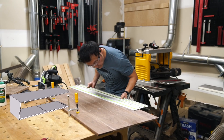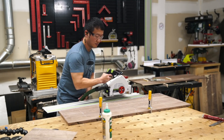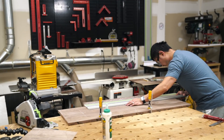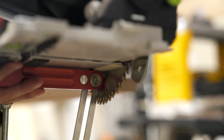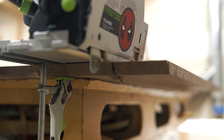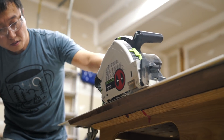I first cut the tapered edge on the right half of the top panel with my track saw blade set at 90 degrees. I'm mentioning the blade angle because the blade will need to be tipped at an angle that matches the taper on the left panel for the rest of the cuts, to ensure that the left, top, and bottom panels will match up. If I'd made the right panel the same way as the left, it'd be really difficult to get that corner to come together since the taper on the top panel would introduce a third angle to the mix. This was precisely why I made the right panel into a vertical partition instead.